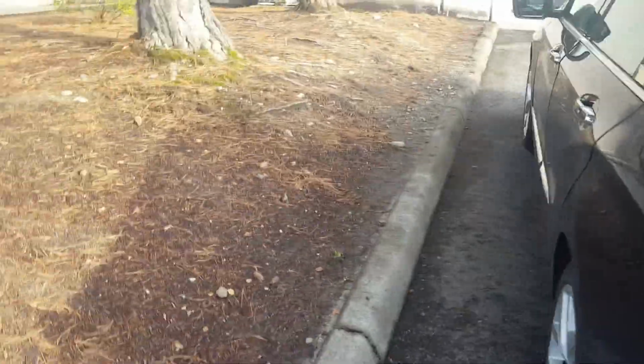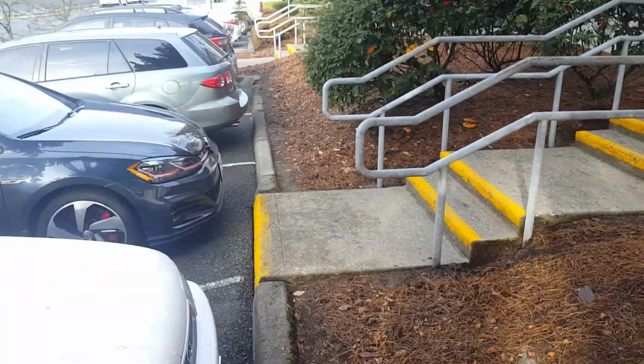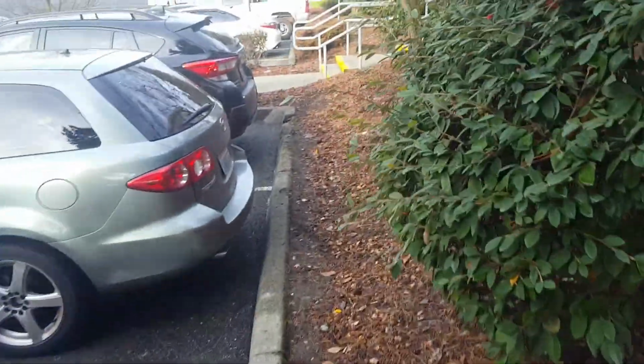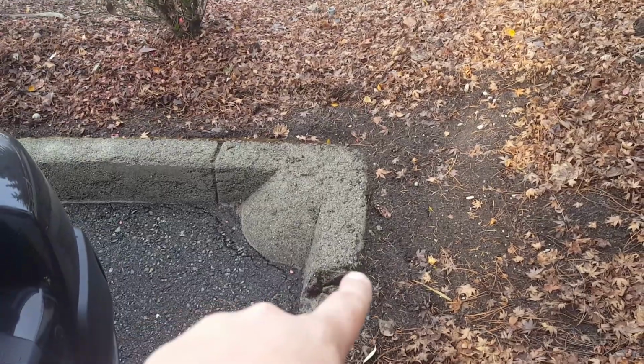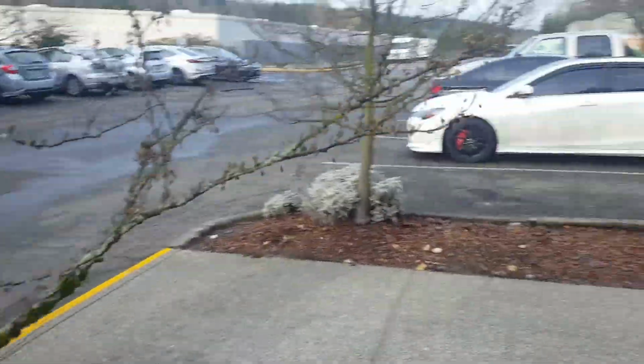Actually, it goes up there from joint to joint. He wants to leave that and use that 8 feet right over here in this first stall by the stairwell. So you've got this first stairwell and this second stairwell. They'd like to replace from this joint down to the corner. We can either saw cut right there, which is what I would probably do, and then just leave this corner, or you can take the corner out, but let's just saw cut right there.